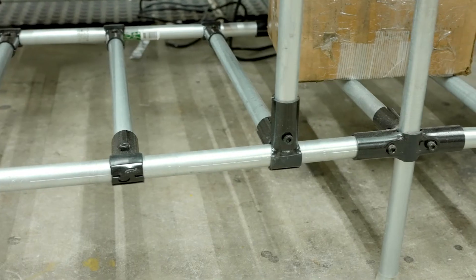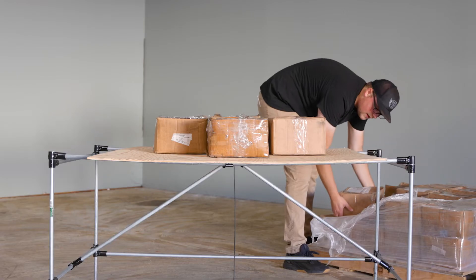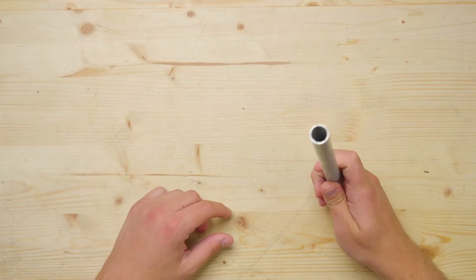This isn't the only bracing method, but it is really strong. If your project allows for shorter spans of conduit, that will really sturdy up a build nicely. Another great technique is adding verticals where needed to support extra weight. We could have done that with these frames, but we were more interested in testing the horizontal strength of conduit rather than the vertical strength. After adding those two braces to the frame, the half-inch conduit structure held between five and six boxes of steel parts — about 150 to 180 pounds, which I think is great considering how small half-inch EMT conduit is.